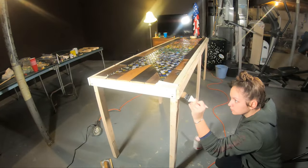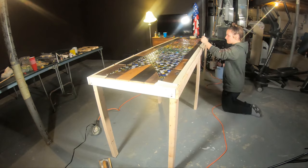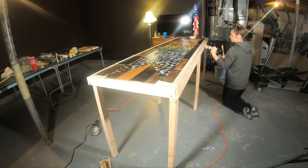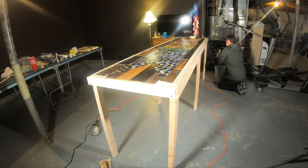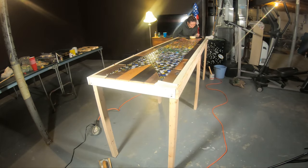The instructions of the wood conditioner stated to apply liberally with a brush and allow it to sit for 1 to 5 minutes before wiping off the excess in order to allow it to soak in properly. Since this was a pine table, I waited the full 5 minutes. After wiping off the excess, I waited 15 minutes before applying the stain.